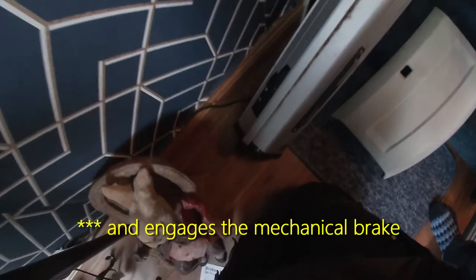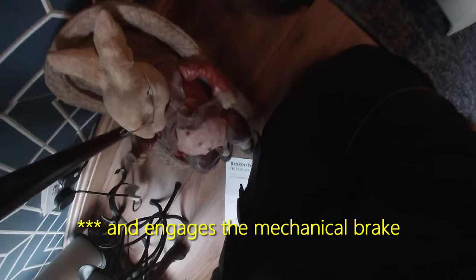Oh, yeah. But yeah, it's working fine. It's flying up. I see what you mean. Now, the part that actually went was this part here. That's your overspeed governor. As you're going downstairs, that's moving left and right, and if it goes too far, that's when it hits a switch and won't move anymore. And there's a tiny little spring. You probably won't see it. It's under the motor there. It's ridiculously tiny, too finicky. But yeah, that's back in.